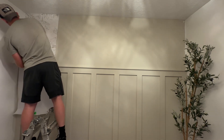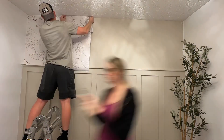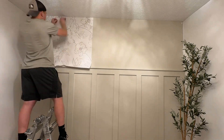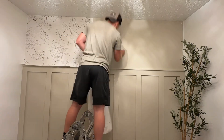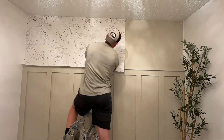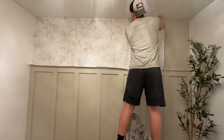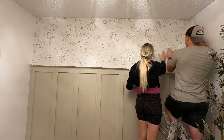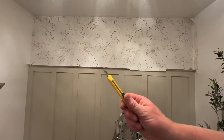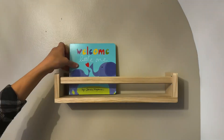This wallpaper is super easy - it's just a peel and stick. You want to leave excess on top, bottom, and sides to trim off later. That'll be especially important if your ceilings or walls are out of square just a little bit. All the sheets are numbered one through five in our case, so you can't screw up the pattern, and the number is at the top so you don't get it flipped upside down. The last piece was the only one really tricky to trim because it runs into a three-way corner. Make sure you have a sharp blade because this wallpaper is actually pretty thick.